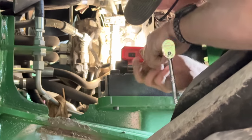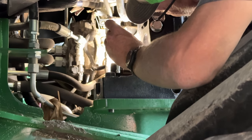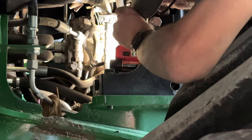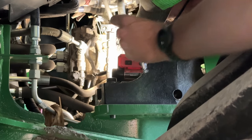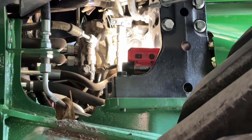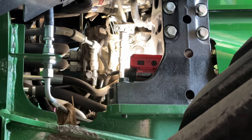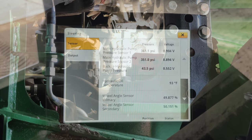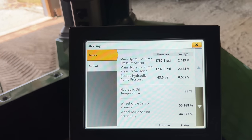All right, so we figured out the lock nut's a 3/8, and the little Allen is a 3/32, and we're going to try to just turn this thing a quarter turn, and then we'll check and see what it is. You're there. All right, you want to lock that nut down too? Yep. Okay, we did a quarter turn. Let's see where she's at now.